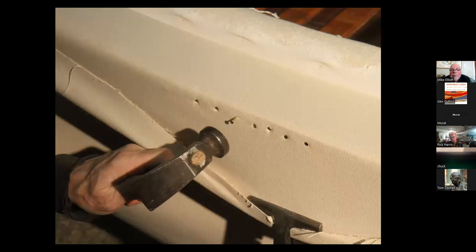Once it's been attached, the canvas is then stretched. The original builders in the Old Town factory would pull the lower section up first, then the top section would fold down on top. I did it both ways, one side each, just to see if there was any difference — and it really doesn't seem to make a lot of difference, although doing it from the bottom and then the top results in a slightly nicer finish.